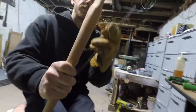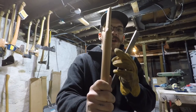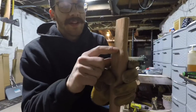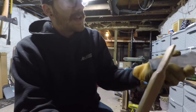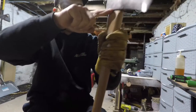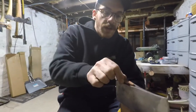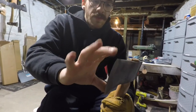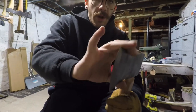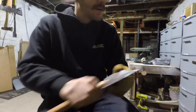Now what I'm doing is knocking down these big shoulders and making a nice taper into this part of the handle so when the axe sits down on it, it doesn't just stop. We call that a ninja shelf — the head goes down and stops right there, with a protrusion sticking out. We'd still put a wedge in, but once the head gets work done on it — getting blown into logs — it's going to loosen right up. So we want a nice taper there.